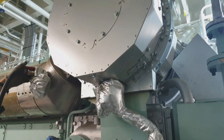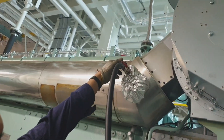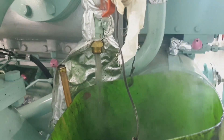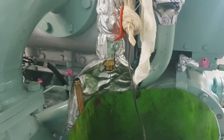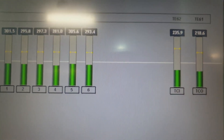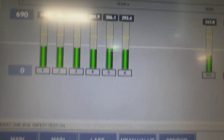When the exhaust temperature of the turbocharger drops below 100 degrees, close the water washing until the turbocharger temperature reaches 150 degrees centigrade. Then repeat the sequence until the drain water coming out is clean, light gray in color, and free from bigger soot particles.